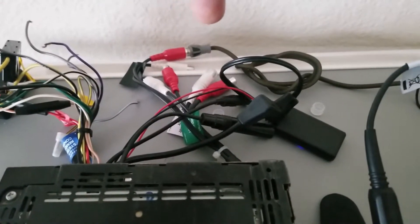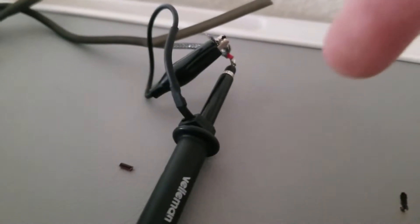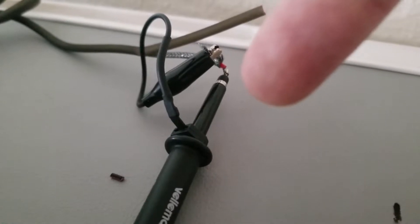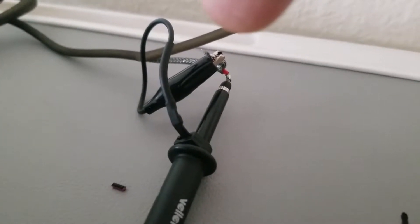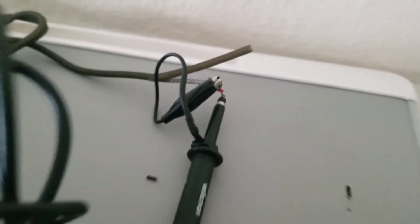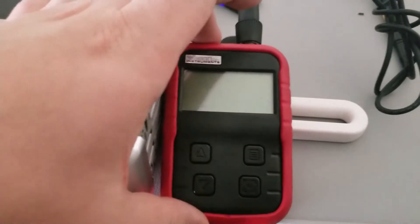The RCA outputs are connected to an RCA cable that I destroyed and cut the ends off so that I can get the positive signal that comes out of the red wire and goes into my oscilloscope probe. The ground, which is the other wire and shield inside the RCA cable, is being pinched by the alligator clip and goes into my oscilloscope.